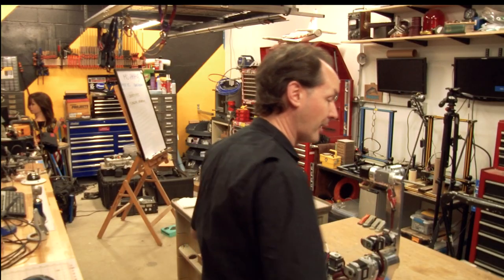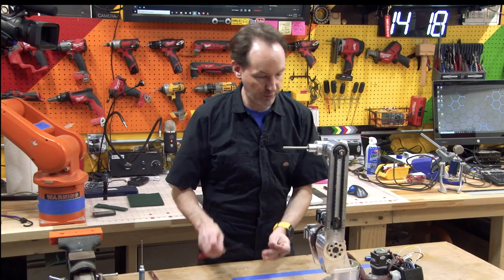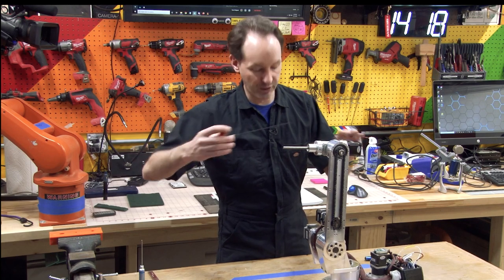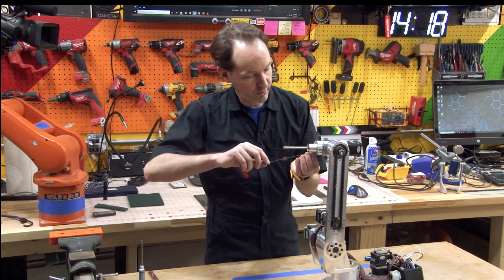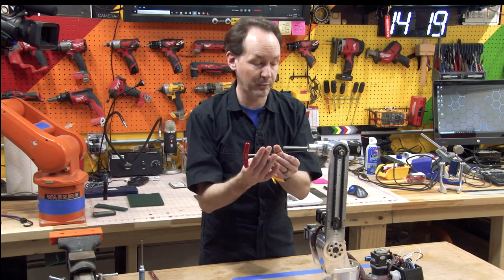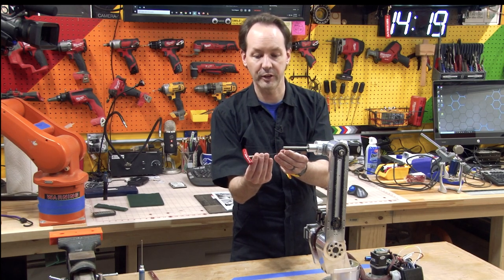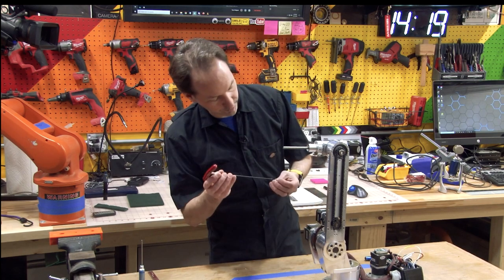And for the last step, we get to grab our M4x5 screws. These are also little grub screws, and these are gonna go in this end. All right, now I'm just putting these in until they just kiss, because these are going to preload these bearings. These are designed to take slop out of the system. These are not designed to bind things up, but if you over-tighten them, they will. So you can see I'm just running this down with just fingertip pressure until it just thumps. Okay, so that's what you're going for. Watch my tool. Thump. Okay. That's all the harder down I'm going.